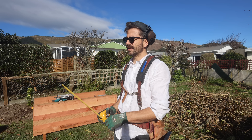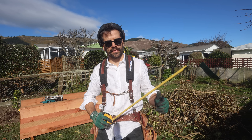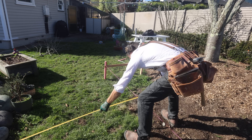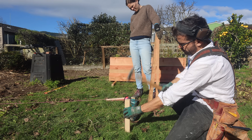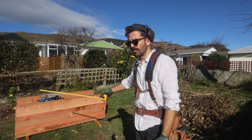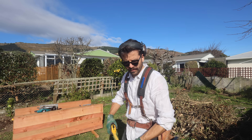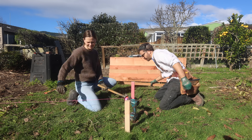Anytime we're building stuff outside — we do it with houses, we did it with a deck — we put these pegs in place to hold our string lines. The string lines give you a visual idea of where the thing you're building will be in relation to the landscape. That gives you a chance to get things parallel to fences or square off houses. Sorry about the wind. In this case we are going parallel with this planter edge across here.